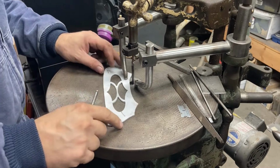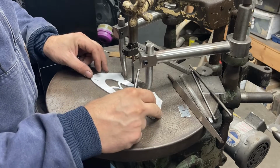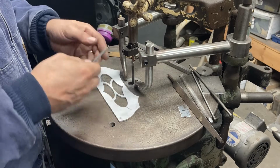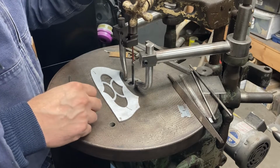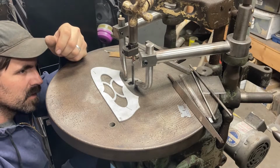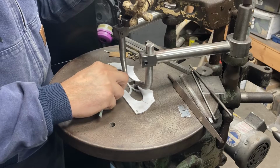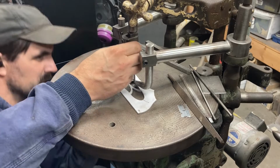Over here at the die filer, I've got these arms adjusted down to where they're just barely hovering on top of the work here, not really pressing on it, but it also can't ride up at all before hitting these feet. Now we just got to undo this and lift. Well, that's actually not the case. In this case, I actually have to undo the bottom two so I can thread the file down through the work, because the hold downs are in the way. But that is not a problem.